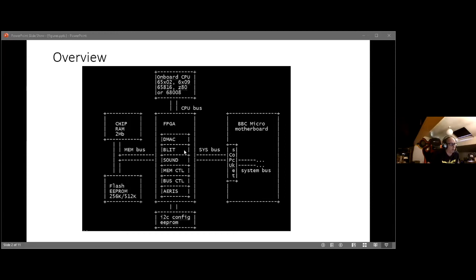If anybody's familiar with the Amiga, it had a coprocessor that did really fancy raster graphics stuff. It's like some of the demos that have been coming out recently where people are chasing the raster and doing stuff at specific instances in time to keep up with the beam drawing the graphics. This makes it a lot easier. It's basically a really simple CPU that is timed to follow the beam as it traces out the graphics. So you can say, I'm going to wait until I'm on line 25, position 6 across the screen, and then I'm going to poke one of the palette registers.